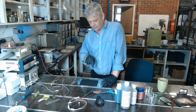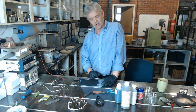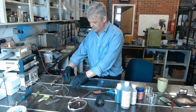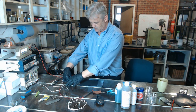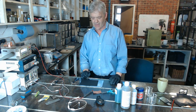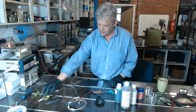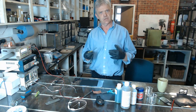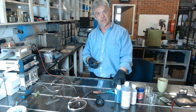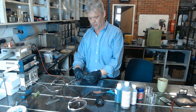Now this plastic is conductive throughout as well as across its surface. So instead of connecting to the plastic and maybe breaking it, I've got the plastic on a bit of aluminium and I'll connect my negative to the aluminium, because that is going to attract all those positive metal ions and deposit them on there. Then I attach my positive to my wand. The wand is actually the donor metal — in this case zinc for the zinc plating solution, nickel for the nickel plating solution, copper for the copper plating solution — and that gets attached to your positive in wand plating.